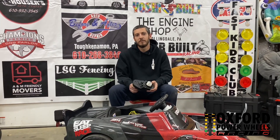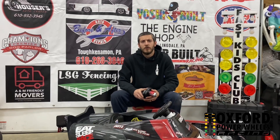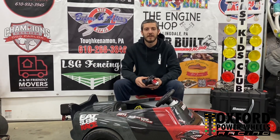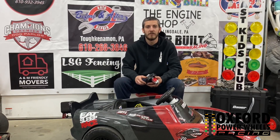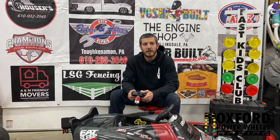What's going on guys, it's Teeter here from Trevor's Fast Life. We want to show you guys a little secret to really make these power wheels go super fast. We ran into numerous issues with our previous setups, one of them being shredding first gear — a lot of violent shutdowns when the kids let off, which causes gears to shred, first gear being one of them, or even the main drive gear taking a chunk out of the tooth.